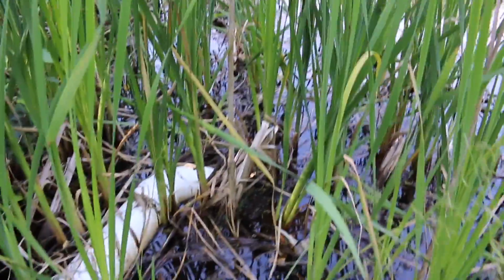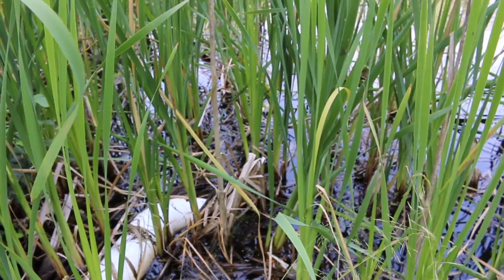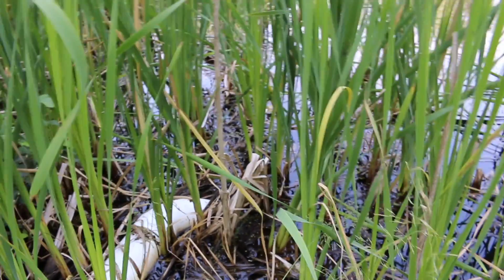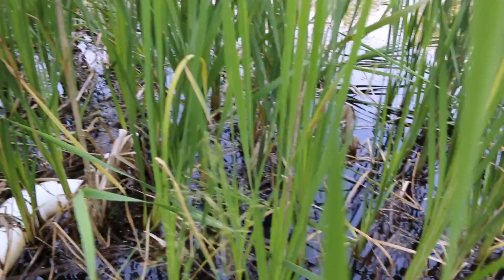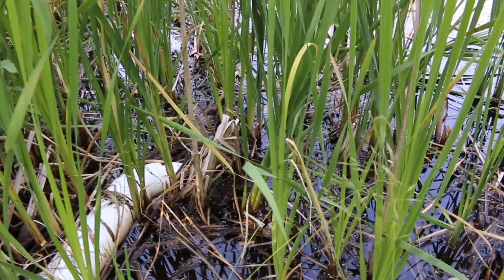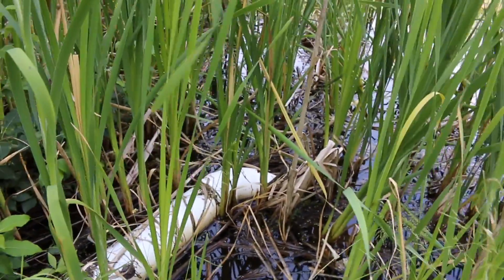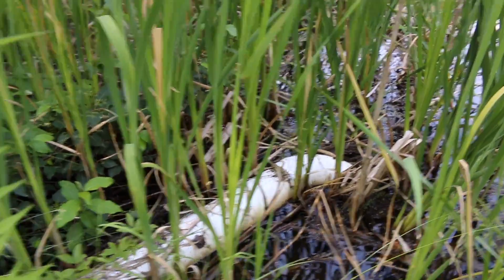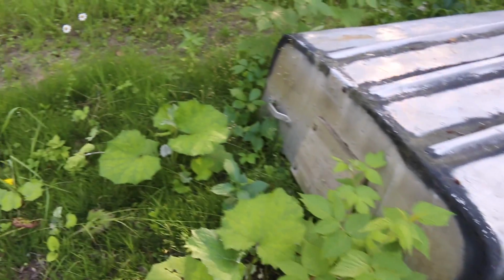And you don't see it, there's a lot of cattails here, but there's a screen that's a stainless steel woven mesh. It's pretty heavy duty anyways. And it's about 4 feet long, just to make sure it doesn't clog up. And actually I haven't even cleaned it in like 2 years and it's not clogging up. So there you go, that's a 6-inch PVC pipe. It goes underground here and it attaches to a 6-inch non-perforated weeping tile.